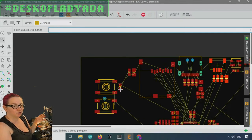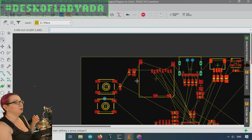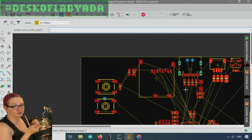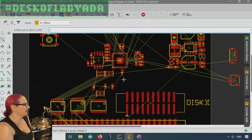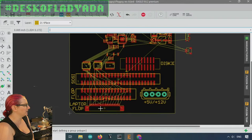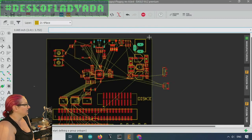Another idea: if I have two extra GPIO, I could put a USB Type-A port, and then you could plug in a USB key. If you're emulating or dumping floppy disk images, you wouldn't even need a micro SD card — you could dump straight to a USB key and pull it out and plug it into your computer. We've got USB host working with mass storage on the RP2040 pretty well. I think the interfaces I'm going with are: laptop 26-pin, 2-by-17 standard floppy, 2-by-25 SCSI, and 2-by-10 disc II.